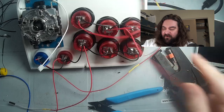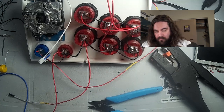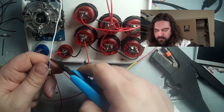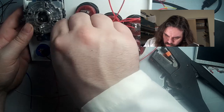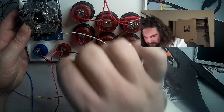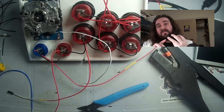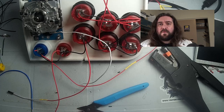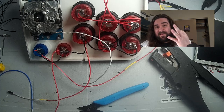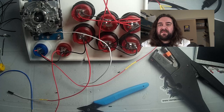I'm making the arbitrary decision to use the 90-degree connectors for our grounds and the straight ones for our signals. Now, if the micro switches on your joystick have three pins, one is going to be the common, one normally closed, and one normally open. We want to hook up to normally open — hook the ground up to the common and the signal to the normally open pin. Normally open meaning it's an open circuit — power can't flow through until the switch is pressed.